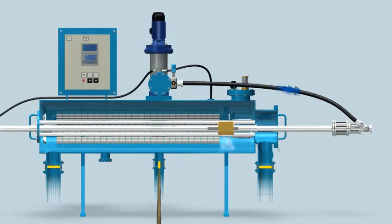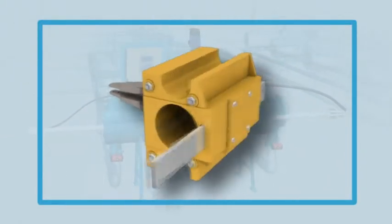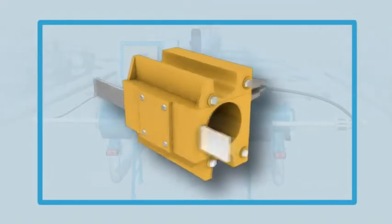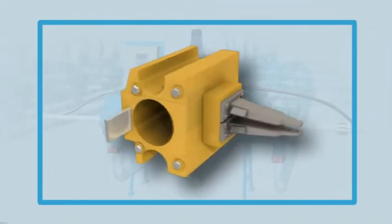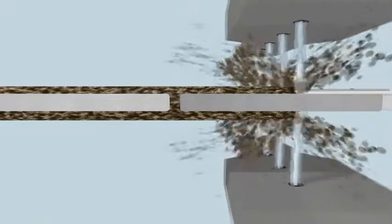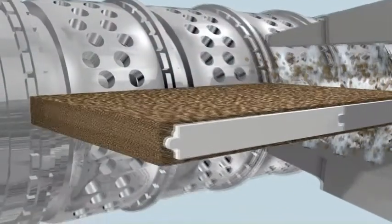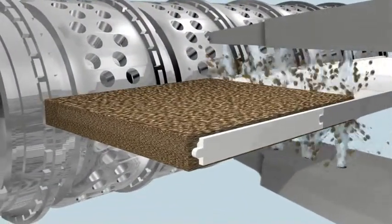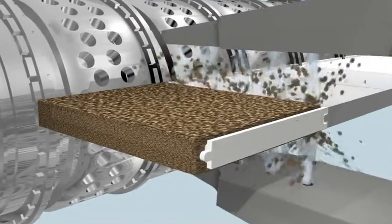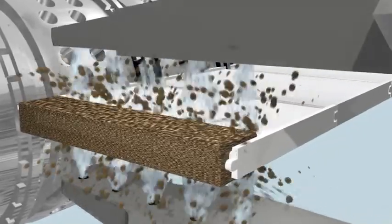The flushing control valve opens, allowing the boosted water to flow into a shuttle pipe fitted with a movable spray unit. The spray unit moves back and forth along the entire length of the cartridge, pushed in both directions by a boosted water pressure driven piston. Each spray nozzle creates multiple jet streams. The water jets pass through the layers, hit the plastic wall, and are forced backwards, creating a powerful spot back-flush which carries trapped particles and the filter cake out of the cassette's thread layers and through the open drain control valve to the gravity drain system.